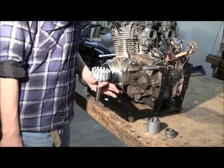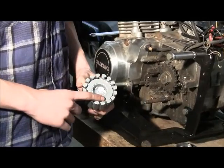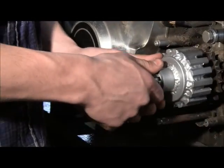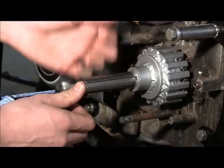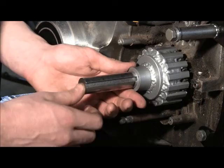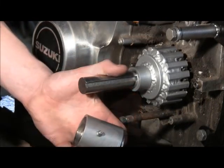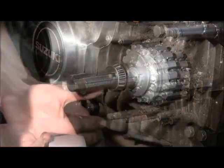We got the engine on the frame, and this is the driveshaft extension. We started with thick-walled tubing and welded on 7/16ths metal rods so it will fit right over the existing sprocket. After that we put another piece of pipe inside of there, and inside of that we put a one-inch short piece of splined driveshaft. Then we took another piece of pipe and machined it so we can fit in taper bearing collars.